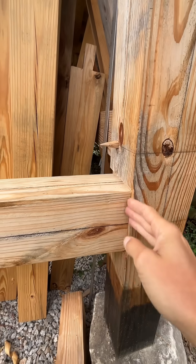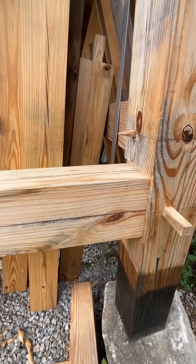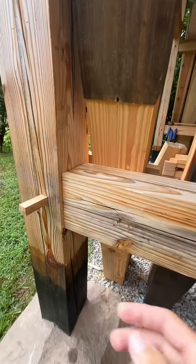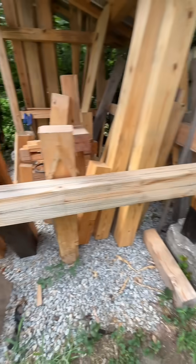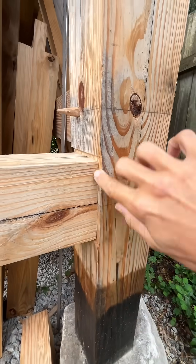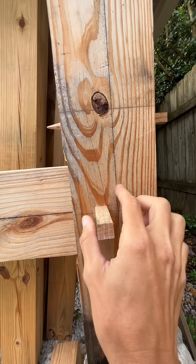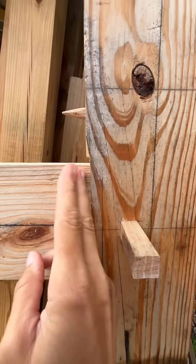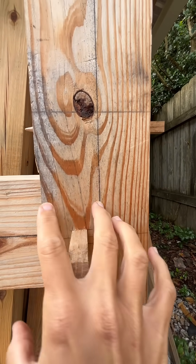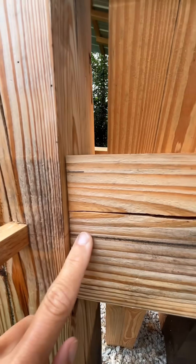But we can't just completely ignore this because this shoulder does need to fit here instead of having weird gaps. So when you're using center lines, you're frequently going to either have fully housed tenons that help compensate for that, or you're going to do some sort of spot sizing or reductions, like this visible reduction here. So this is a five by five — let's pretend that this distance from here to here is two and a half inches, and that the timber at this point had this little extra bit beyond the two and a half inches. So this is being sized down or reduced so that it's the exact right dimension to accommodate the shoulder of this tenon. When your center line joinery is done well, you're going to see all of your lines match up, which is a very satisfying feeling.